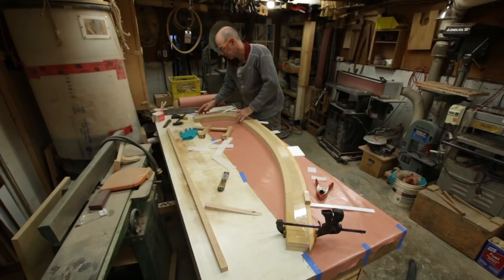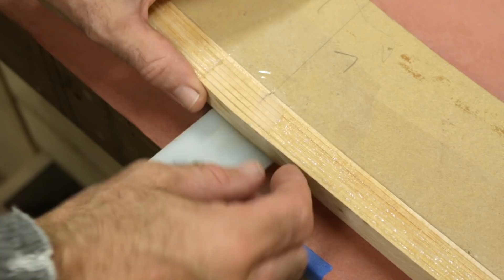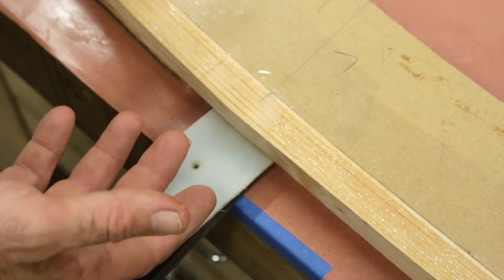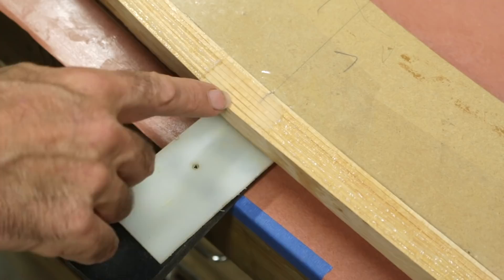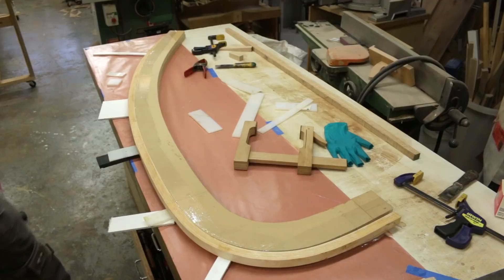Again the spring back is just about perfect. Over here we have a slight problem - this is where I had some blocking to try and force this lamination together. Remember I said I didn't use a backing band? You can see I didn't have a clamp right here and you can see how those laminations are just spread out just a little bit in this spot - I got a little hump. It's not going to be problematic for my finished product because it's fair on the inside, and that's the face that's important to me. But this is a great example of why you need to use a lot of clamps with thin laminations or you need to use a backing band. I really should have taken the time to get a backing band happening.